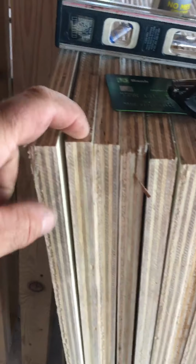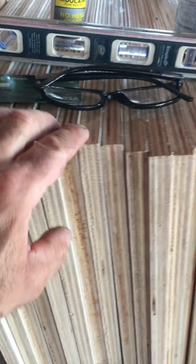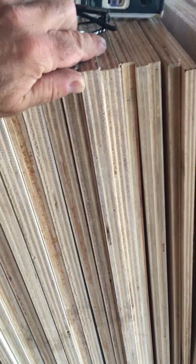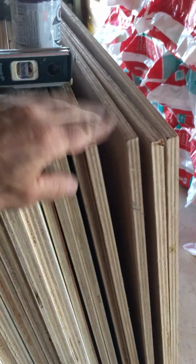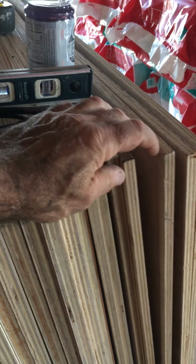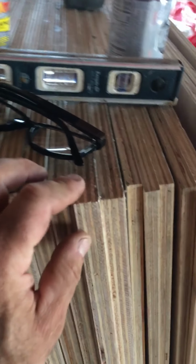And that's the reason why, if you're wondering why we're putting plywood on the inside of the space, the plywood is the substrate for the tongue and groove. We're using 3/4 inch tongue and groove teak, and we have to floor nail through something, so we floor nail through plywood. So the ceiling gets all 3/4, and then partially on the way up the wall is 3/4 for the tile, because we had to build out an extra quarter because the tile's not as thick as the flooring. And then at that point we jump to half, and on top of the half is the teak, and on top of the 3/4 is the marble, and that makes them come flush when they meet each other.